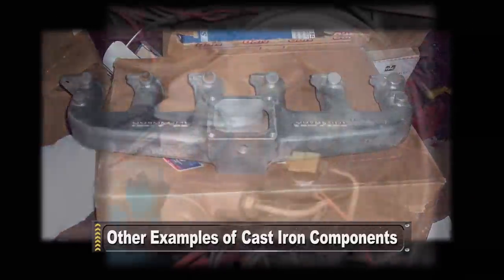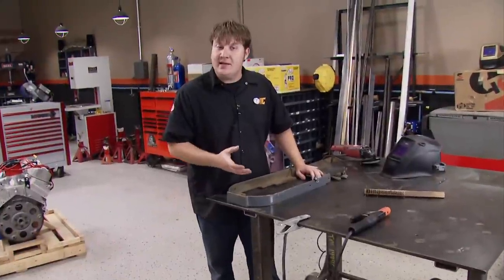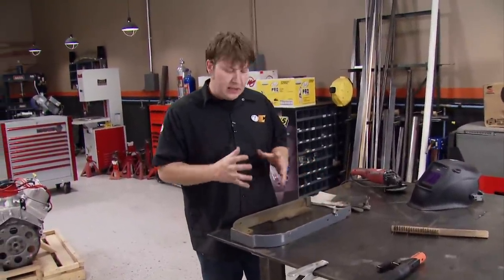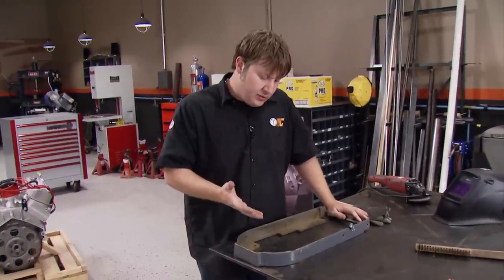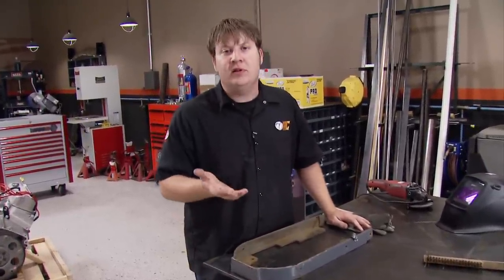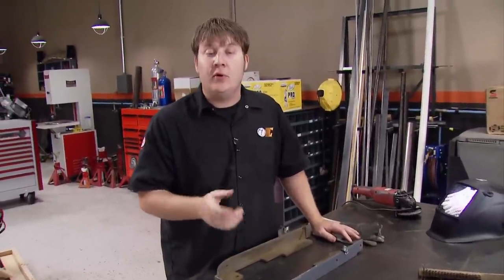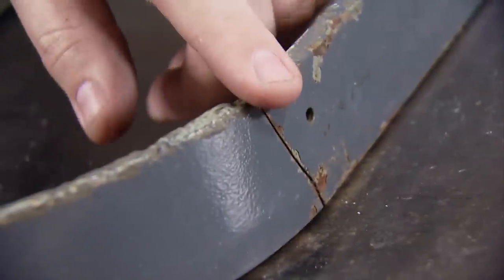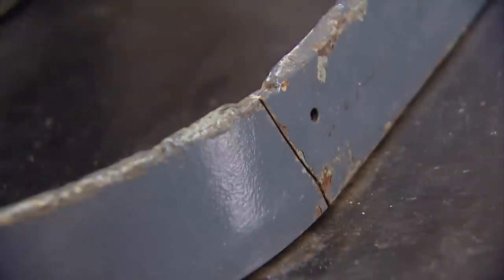The material will either crack or break apart again shortly after it's welded. The reason is that when cast iron is heated to its melting point and then rapidly cooled down, the cast iron can't withstand the expansion and contraction rates, and that causes it to crack or break. Usually when people start running into issues, what they've tried to do is run a big fat bead and just let it cool down, or even worse, force cool it by using water or even air. The key to welding this stuff is to either never let it get too hot, or don't let it cool off too quickly once it does get hot.